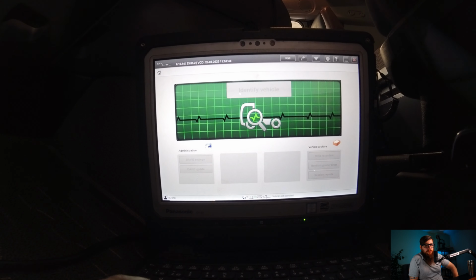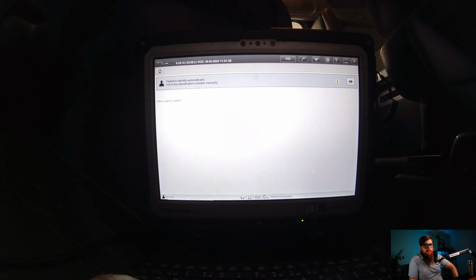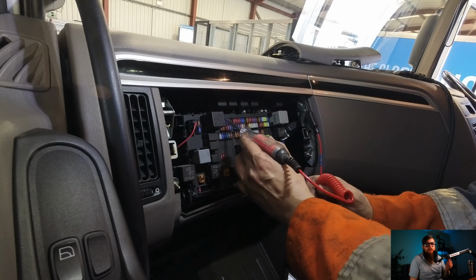With DAVIE not wanting to connect due to the low battery voltage, I decided it would be best to charge the batteries first and start with some basic tests, such as do we have any blown fuses, as you can never get that many warnings without a power supply issue. This is where your diagnostic methodology would come in.